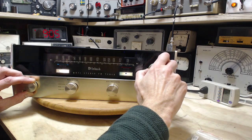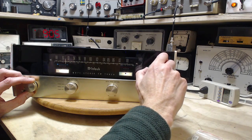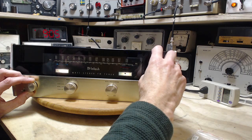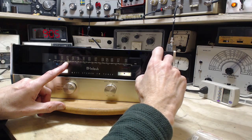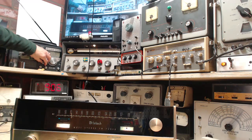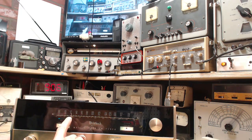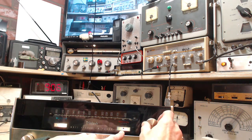Wait a minute — that's not supposed to come on. I said this wasn't stereo, but that should be stereo. Maybe I'm mistaken about the tuning — maybe it's not quite right, and it's really 91.5 where it says 92. I know how to find out. The front panel is off a bit — so it's really 91.5 where we are. That one is mono; this one is stereo. If you notice, the tuning indicator never gets quite to the middle — I think I can fix that.